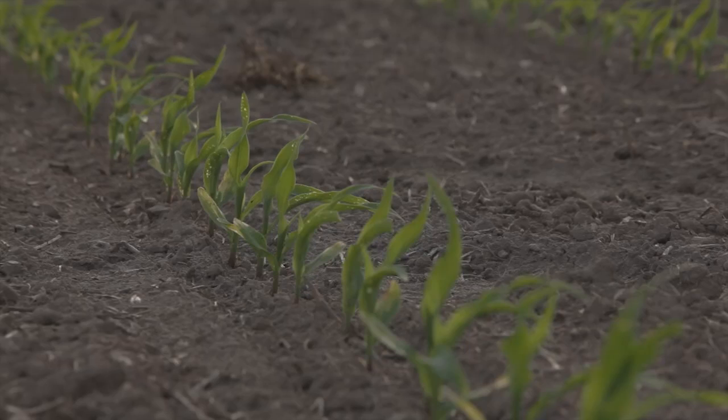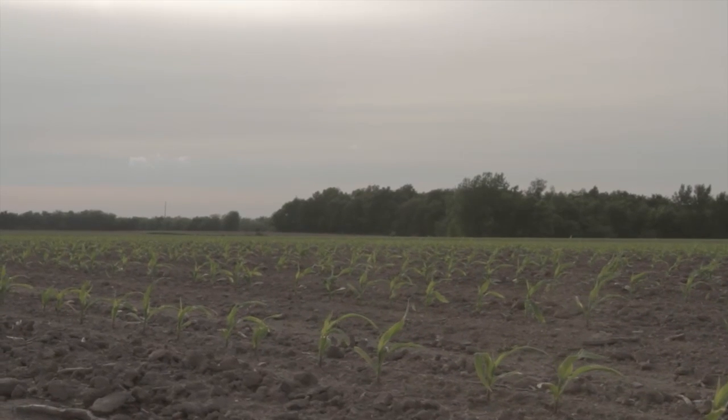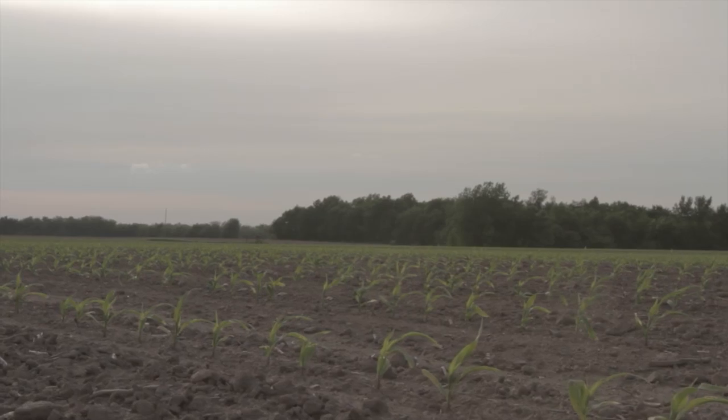The other thing that we're after is photocopied plants and ears. This is when you go out to your field and each one of those plants is the same size, the same stalk diameter, and about the same size of ear. That photocopy part is difficult to achieve in your fields, but it goes back to a lot of little things we can do on that corn planter to get uniform planting depth, make sure we're planting into moisture, get good seed to soil contact — all those types of things to help that uniformity come.